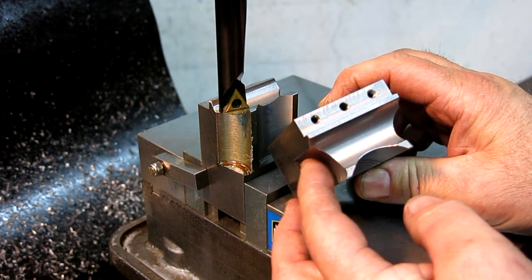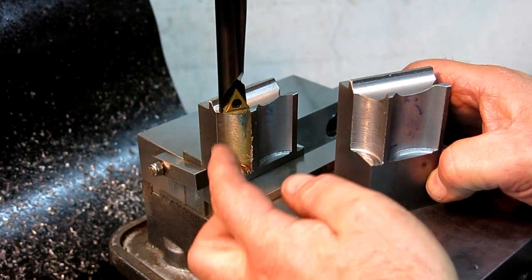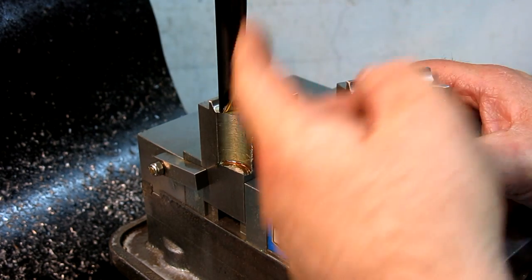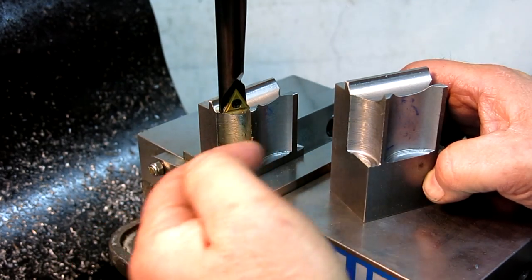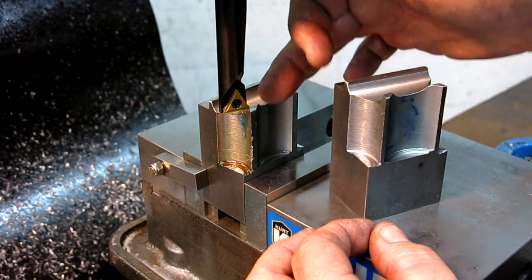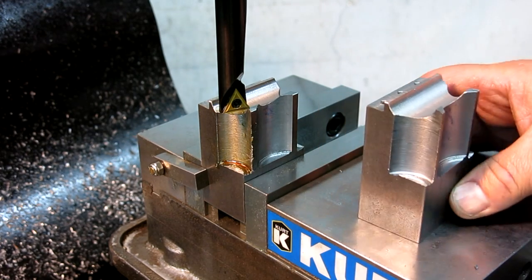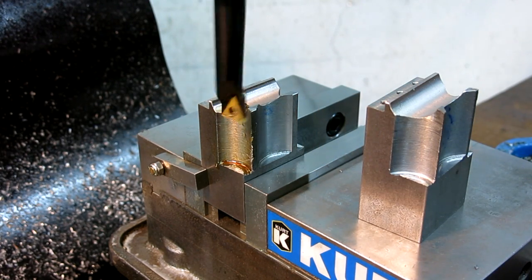So this is after the rotobroaching — just a roughing pass to remove that material. We're going to use the same trick: the radius is already set on the boring head, and we're going to work our way down, keep moving in until we're on the correct radius center, and rinse and repeat three more times. We're looking pretty sassy — let's get with the program.